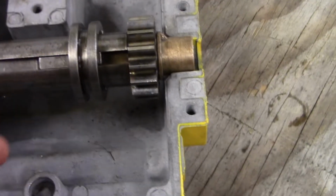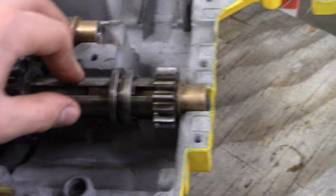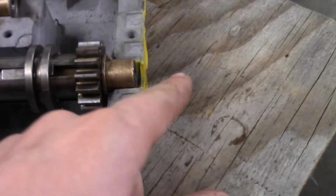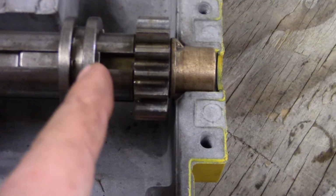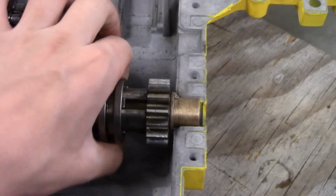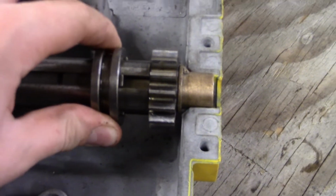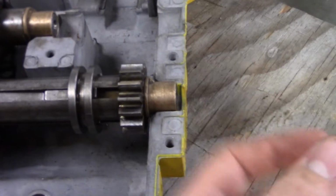You can kind of tilt this up maybe somehow. You can pretty much do it one-handed, where you hold this with your other hand. You stick these shift keys out very far, almost to when they're going to fall off. If this was a shift key, that'd be a good spot to have it sticking out. You hold them all like this, and then you take this shifting collar, and you let one of them loose, and well, actually you do two.